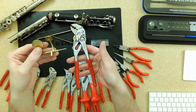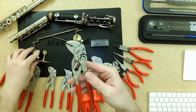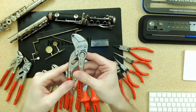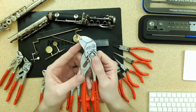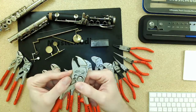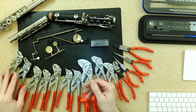We have two different sizes — medium and small — and you can go on Music Medic to check out the different hole diameters to make sure they apply to your application. We also offer a single-hole plier where a lot of technicians like the Knipex jaws but need a hole right at the very end in a larger diameter for clearance — we offer that in a five millimeter diameter. We do offer custom size holes, but custom sizes take a while because we have to wait until we're running a batch of pliers. You're welcome to contact us and we'll do a custom size, it just might take a while.